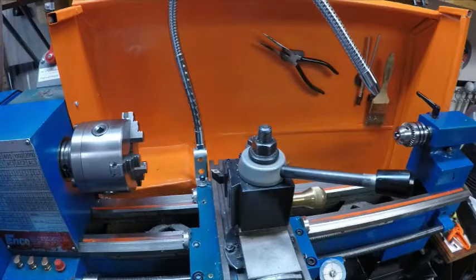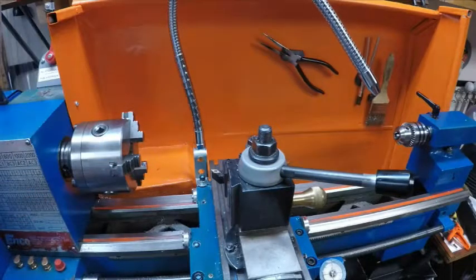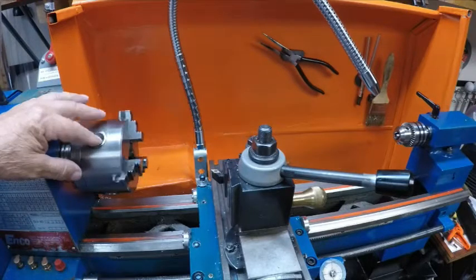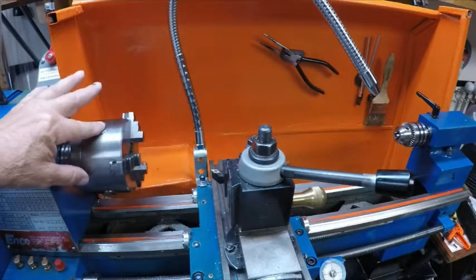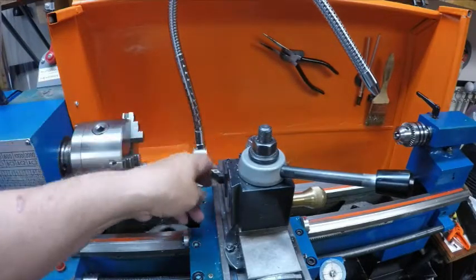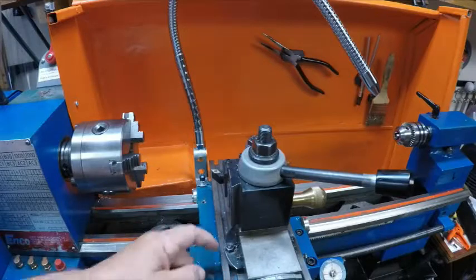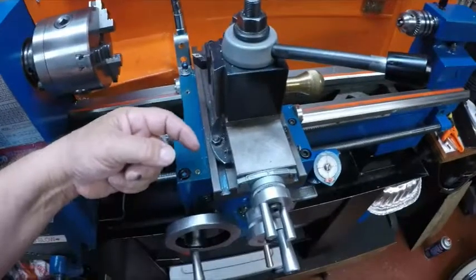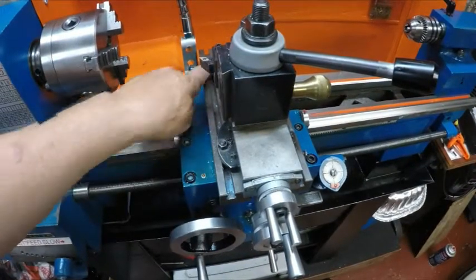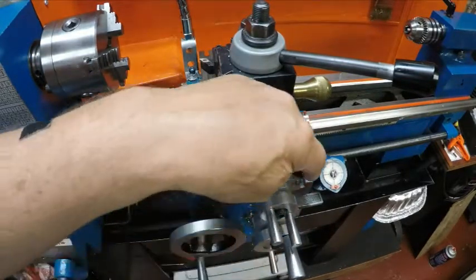See if I can tell you the RPM. No, I don't have it plugged in for the RPMs. But it wasn't very high. It's like my second speed up, which would be around 300 RPM. You can go clear up to 2000 with this — about 1800, 1900 it'll spin up to. Well, my God, if you have it on that, it's really going everywhere. And it comes up these runs here. You'd have to probably put some silicone right at the ends of these to keep it, because it was running out this way towards me, out this way through this slot where the T-bolt goes in to hold this. It's all right going that way, but it starts coming up this way and going out, so I'd put a big gob of silicone here and on the other side.